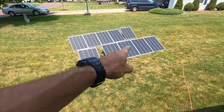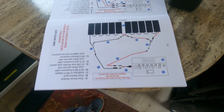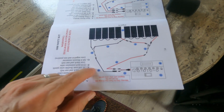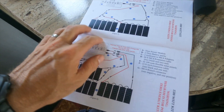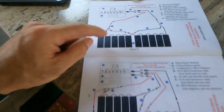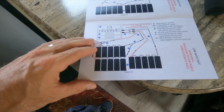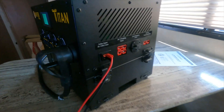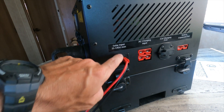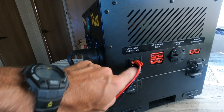That is my 1,000 watts that I got hooked up — each one of those panels is 100 watts a piece. This is how I have it wired up. If you end up buying one of these Titan generators, it shows you in the manual how to wire up 1,000 watts or 1,500 watts. I think they are selling kits with 4,000 watts, but I don't think you could fit 4,000 watts on your camper. You have to wire it up like it shows because you can only put so many volts into each spot — each one goes into the charge controller. It has two MPPT charge controllers.